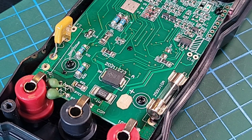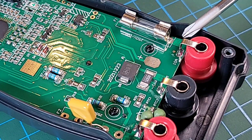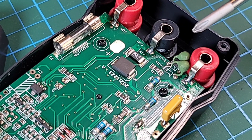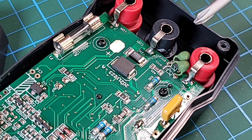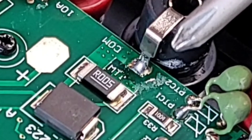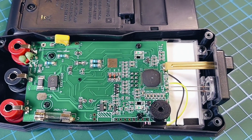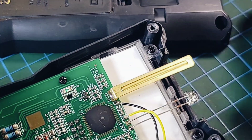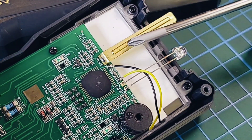Great implementation. On the high current side we have one glass fuse — 250 volt, 10 amp. It is a glass fuse; would have been nice to see ceramic, but we are in the cheapo zone. Split jack variety inputs — they're okay, nice big solder blobs on them, so that's always a good thing. Two PTCs on the voltage side. And look at that — we don't have a current shunt; instead we have a current sensing resistor. Mileage may vary, I do prefer a current shunt myself. Look at the size of that NCV detection — that thing is huge. Let's take off the protective cover and you can see that filament protrudes a lot from the main PCB.